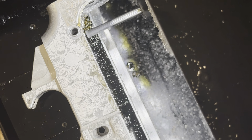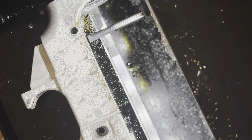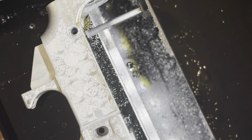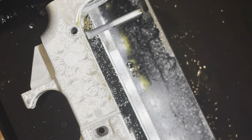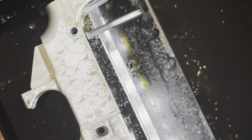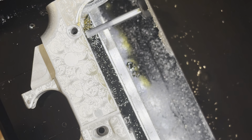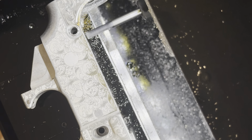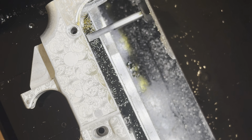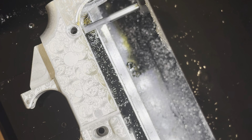Basically it's just going to run its code. It takes a little bit, but you can run it higher if you want. I run mine at 100%. I'm in no rush, so I don't have to do it at 300% or anything. I prefer to do it at 100% or lower just for a better finish — it's what you're going to get by taking your time and knowing the limits of the machine. So there you have it, that's how you use the fixture. I'll send a video as soon as we're done cutting and I'll leave it here until it finishes. I trust the code and I trust the fixture. Thank you so much — let me know if you guys need anything.